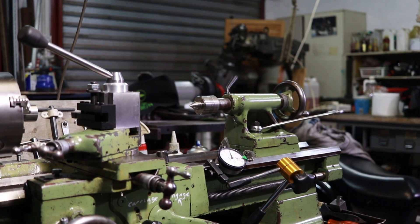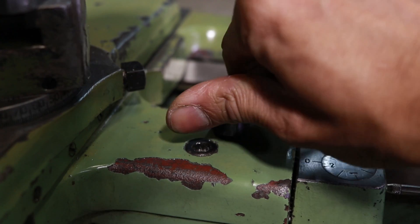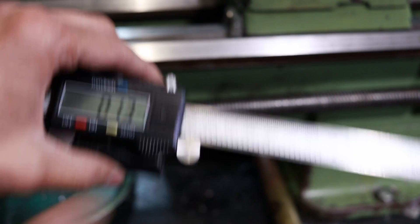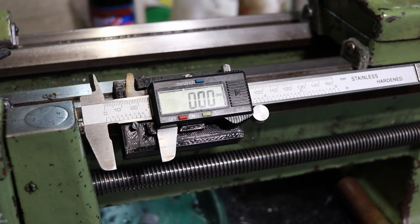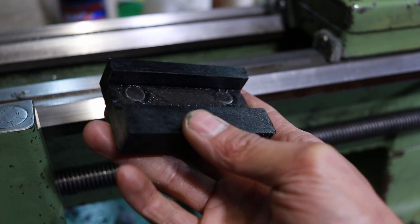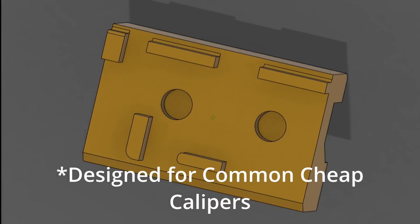Tool tip number two. I found myself doing a lot of turning to a shoulder, whether internal or external. What I would do is set a dial gauge on my carriage, dial in what I needed, then lock my carriage and set a carriage stop. But if I had to do it quickly or do a lot of turns, it quickly spiraled out of control. So I decided to get digital by printing this little caliper mount, which literally just snaps onto my ways, gets a magnet on the carriage, and gives me basically a DRO on my ways. The great thing is it just pushes out of the ways if you run into it, and it comes off easy with two magnets embedded in the top. It really is just a 90-degree angle — you could make it from aluminium, which I was going to do before prototyping it on the 3D printer. It works well enough that I've left the STL file in the description.